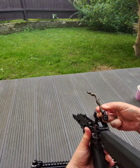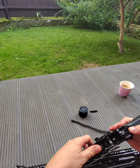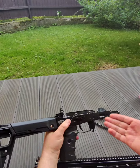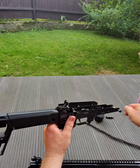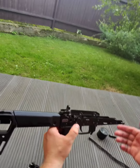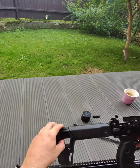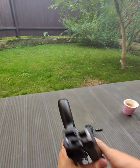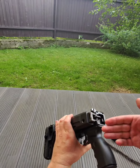The recoil spring is from the AK-100 series or AK-12. You can't close the lower if your trigger is not in position. The lower has a fake third pin, basically because it's a civilian gun. There's a carrier stop here so you can't charge the rifle if it's on safety — you can do a chamber check, but you can't charge it and obviously can't fire it. The folding stock has a latch, and there is a blockage to prevent firing in the folded condition because of Russian laws.